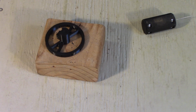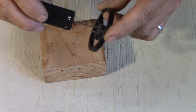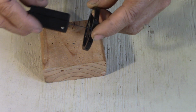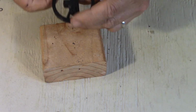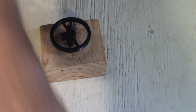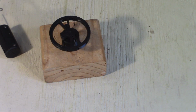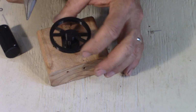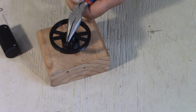Have a balance wheel here. So same thing, work the center hole already. This one I made, it's already too big. Then push the arbor in. Then I made this tool with holes. That way I can put those little pins. The holes on the top part are slightly bigger, so I can install the pin and then hammer.